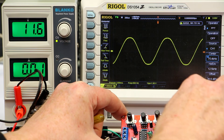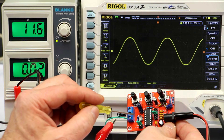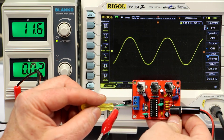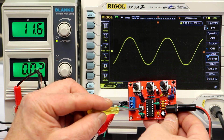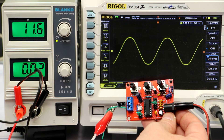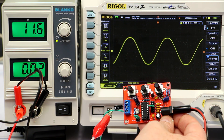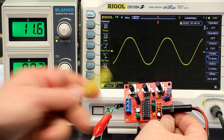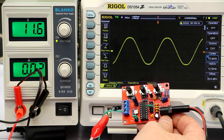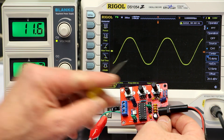I've put the fake Chinese chip back in because I can live with it — I only operate this at 9 volt battery power. The distortion control is working quite well. If you want this, you have to do a little SMD work: this little SMD trimmer fits as a replacement for the fixed resistor. It's not strictly necessary if you use a fixed resistor, but why not optimize this little analog function generator?